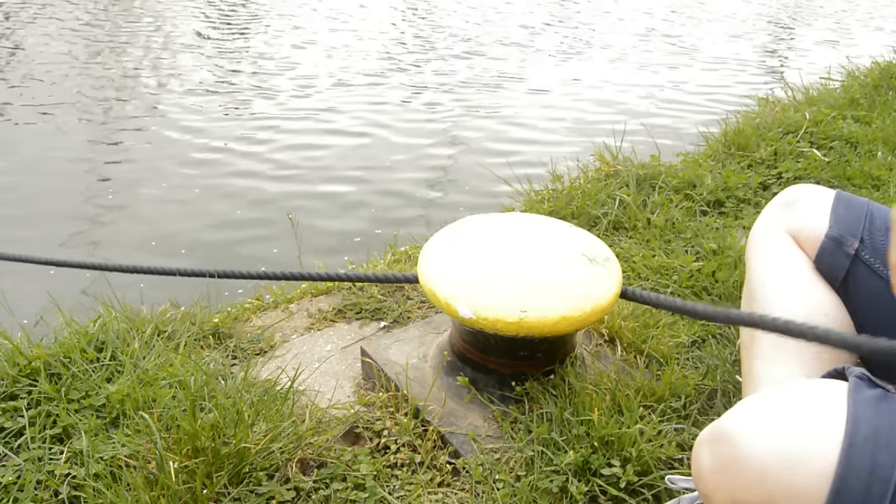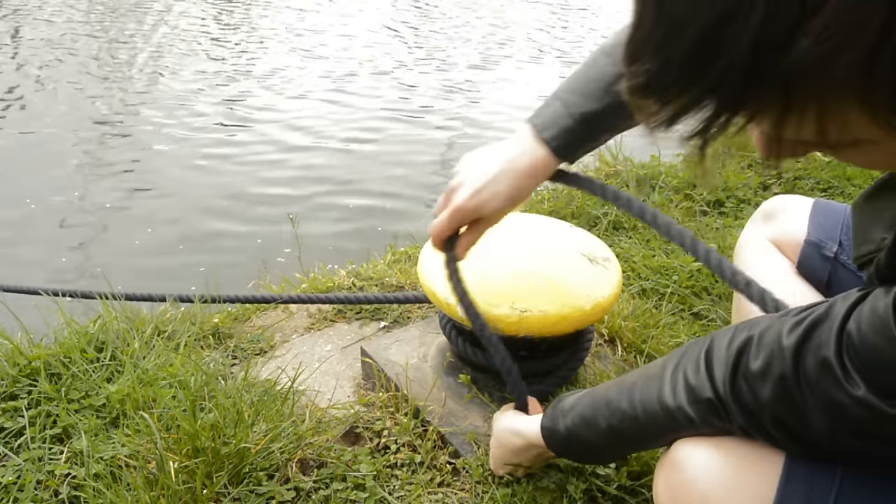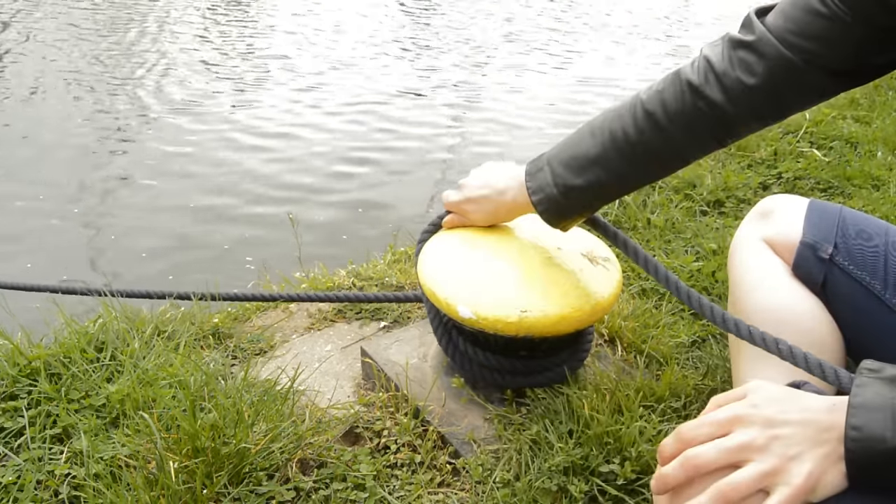The next knot I'm going to show you is really good for locks — when your boat needs adjusting while it's going up and down in the lock, this is a really good one to use. I'm going to call it a half lighterman hitch because I don't really know what it's called, as it's not technically a knot knot, but it is basically something I would use in a lock. You're going to take your rope, wind it around the bollard once, and then as you come around again you put the rope underneath where your first line went and then up again, and just hold it there.